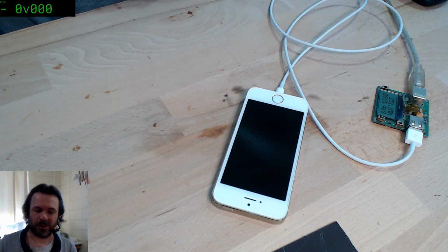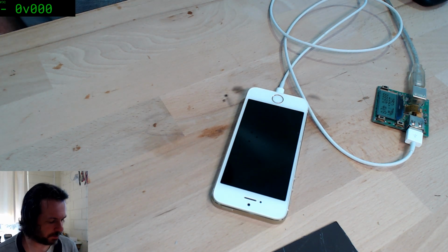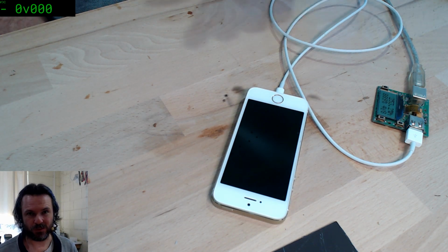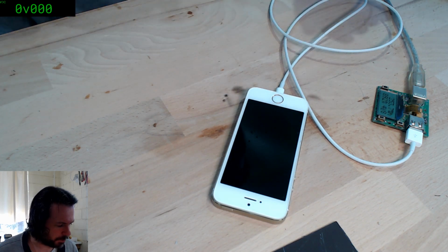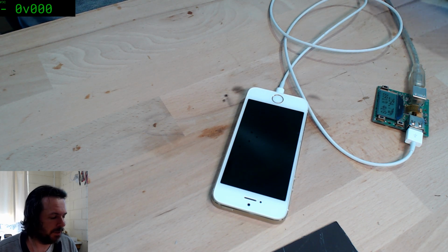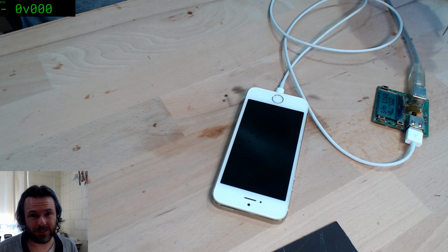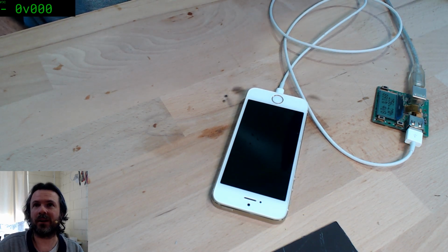Now the reason why I say it depends is because it depends on why the SD card lost the files and data in the first place. If they just accidentally formatted it, then there's a pretty good chance of getting it back. If they scrubbed the card, then there's no chance of getting it back, at least not realistically. If it's a controller failure, it might be possible to get it back.